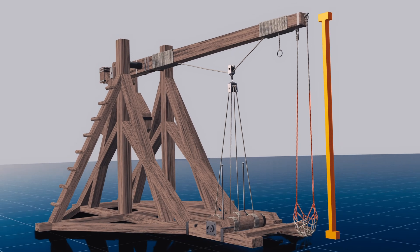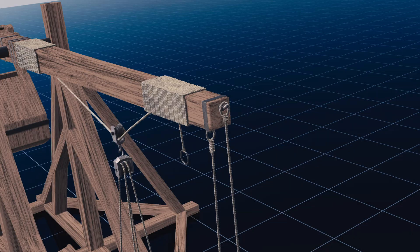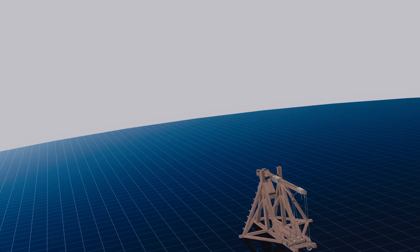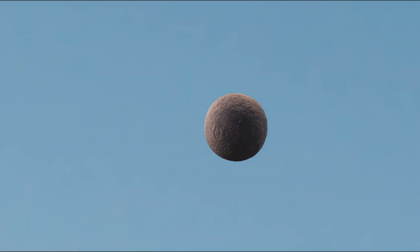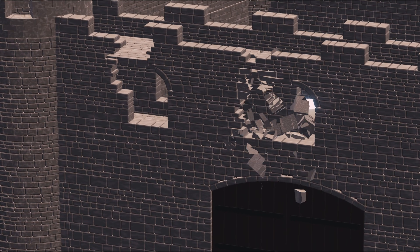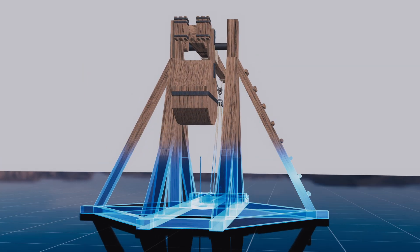The overall length of the sling and adjusting the sling's release point is the primary way of fine-tuning the range. It also changes the trajectory so that at the time of release from the sling, the projectile is traveling at the desired speed and angle to give it the range to hit the target, as the rest of the trebuchet is difficult to adjust after construction.